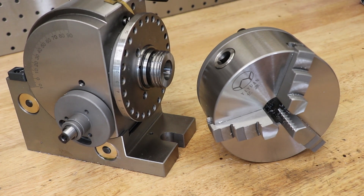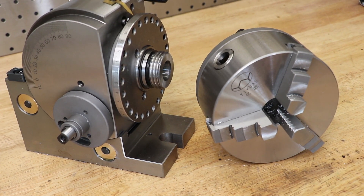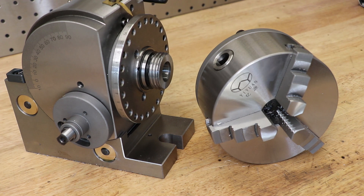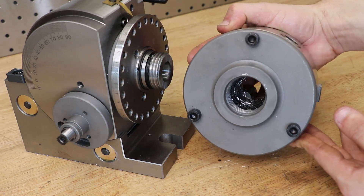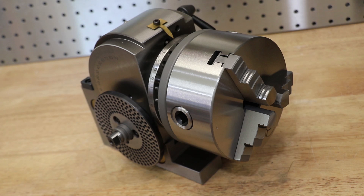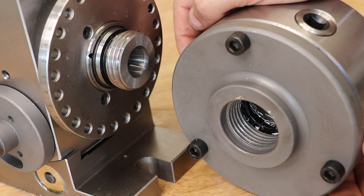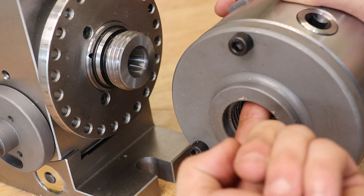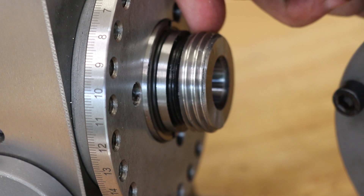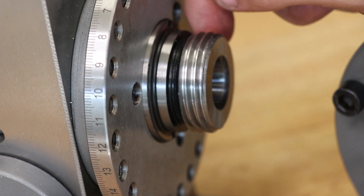I apologize for that not-so-good reenactment of how I actually got the chuck off the spindle — the day I removed it I didn't have any camera gear with me. A big thanks to everyone who wrote in suggestions. This backplate does screw off the spindle; the problem was they over-torqued it at the factory and seized it in place. I had to use a custom jig to hold the indexing wheel, penetrating oil, an impact driver, and leverage from a spanner to get it removed. I was really expecting thread damage given how tightly it was on, but after checking it over I was surprised to find none.